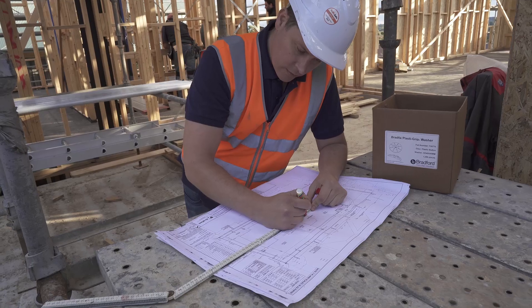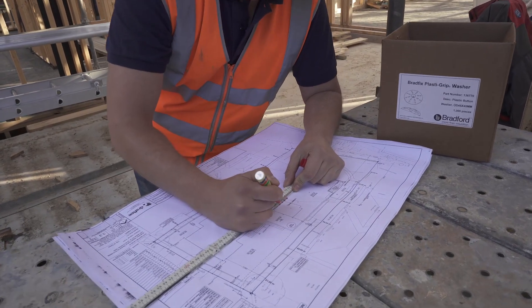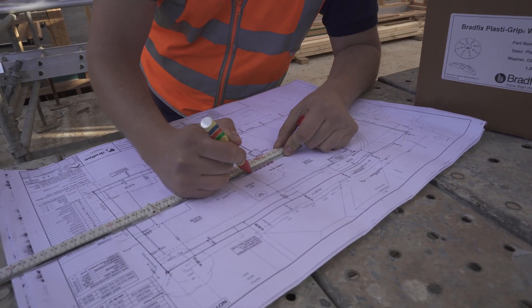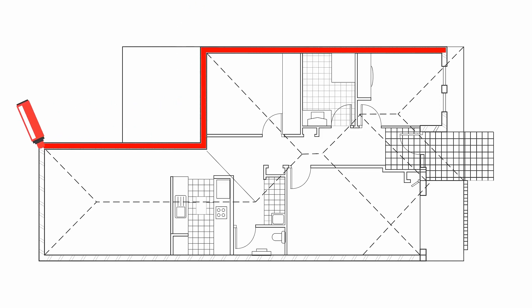The pen test is something that anyone with a pen can do to help get better performance for their project. Start with the simple things first. Pick a point on your floor plan that separates the inside from the outside, like this wall around the lounge room. Now trace your pen around where you think the envelope is without lifting it off the plan. Obviously it follows the exterior walls, but then what happens when you get to this attached garage?